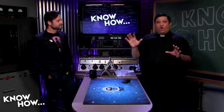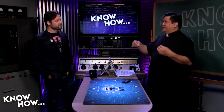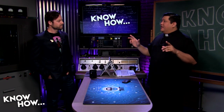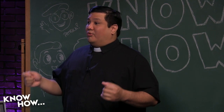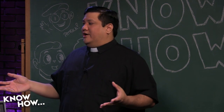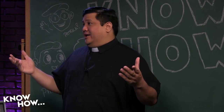Now I know most people would say, well, no, I take care of my stuff. The Raspberry Pi would be on a UPS or a power conditioner. And yes, I get that. But when I'm thinking of an industrial application, and automation is, honestly, an industrial application, I like to think of something that will survive the worst case scenario. It's going to overheat. It's going to shut down. It's going to have some funky shorts that would kill a Raspberry Pi. But to an Arduino, that's embedded life. That's what it does. You power cycle it, and it comes right back up.